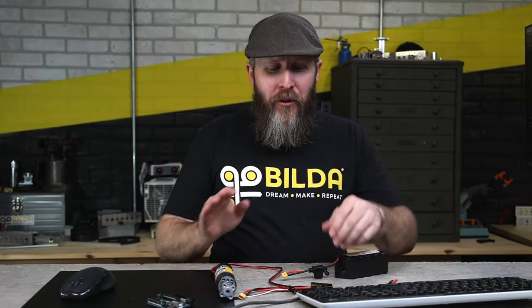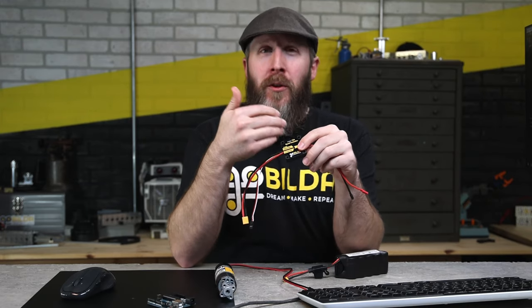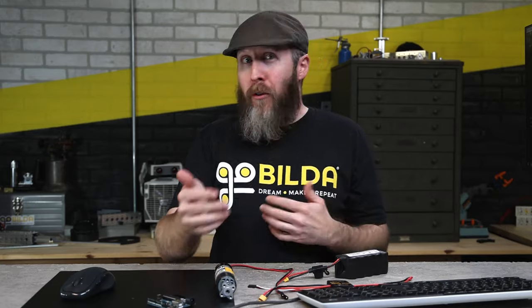In the category of groundwork, I want to talk about motor controllers in general. Motor controllers are sometimes called speed controllers, sometimes electronic speed controllers, and sometimes abbreviated to ESCs. Usually when you hear ESC, that's a motor controller designed for a brushless motor, but that's not always the case. And usually a motor controller has a few more features than a speed controller, but again, not always. We're going to use those phrases interchangeably here because by definition they're pretty much all exactly the same thing.